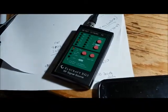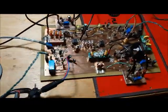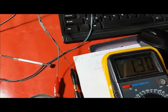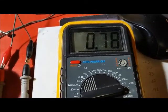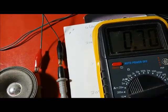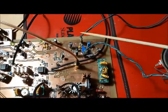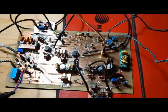With the XG3 connected to the antenna at minus 33 dBm — an extremely strong signal — my S-meter is showing 1.3 volts. At minus 73 dBm it shows 0.78 volts. At minus 107 dBm with the volume cranked up you can hear the tone and it shows 0.7 volts. The plan is that connection will go to an Arduino, which will digitize that voltage and convert it into an S-unit reading.